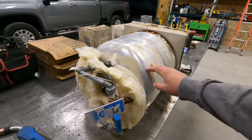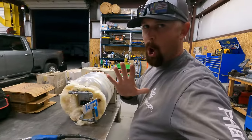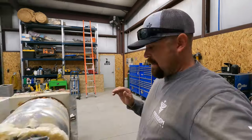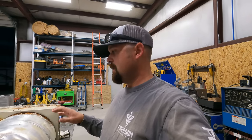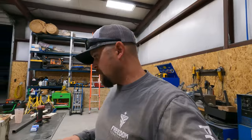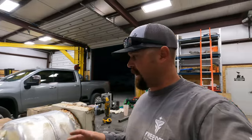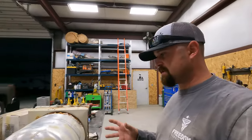So this is an aluminum water heater — before everyone freaks out, I've got all the valves open. Every valve on this thing is open, it's vented, and I've checked it with air — air is flowing through the tank. If you're welding on a tank, you always want to make sure that it's vented, otherwise it could cause pressure to build up and basically you're welding on a bomb. So I've got every valve open and air blows through the whole vessel. We're good.